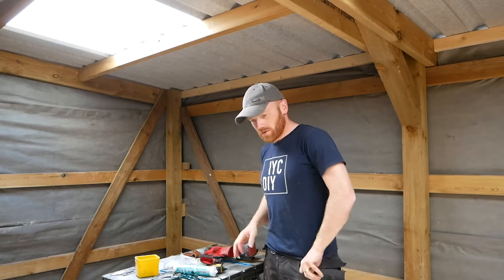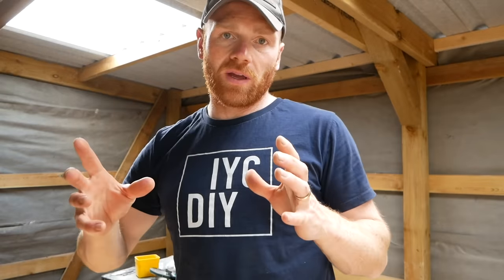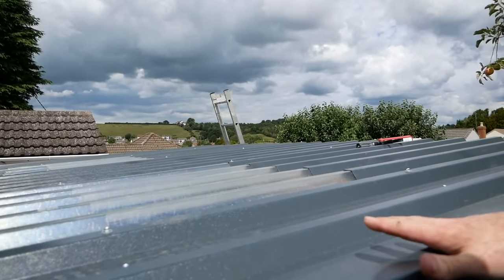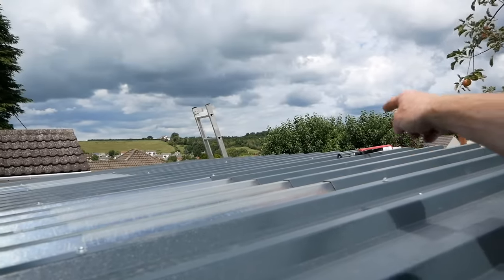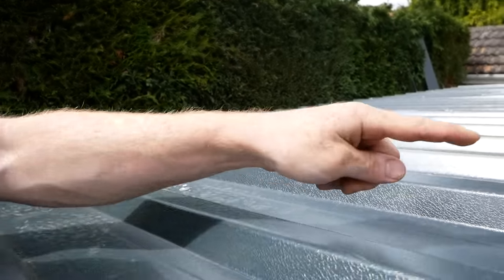Okay, that is it done. I'm afraid you're going to have to put up with just the GoPro footage because I just couldn't be dealing with a camera up there as well. Let me take you up now and show you a little overview of what I've done. The roof is on with all the fixings in the places they need to be — I might come back and put a couple of extras where one sheet laps over another. The spacings I've used: one fixing down through into every purlin — the purlins are about 900mm apart — and every other trough of the sheet gets one of those. And then the stitching screws, which are the shorter ones that go on the corrugation, are at every 600 millimetres going up the sheet.